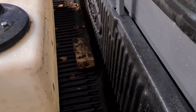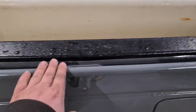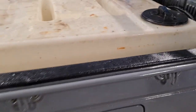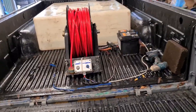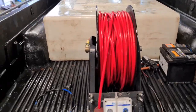So the plan is I'm going to push this tank further up to the bulkhead and put a bit of block of wood in there just to stop that snagging or kinking. Then we're going to weld some of this framework from these bars here, because obviously these are a good structural point of the truck - they're solid, they're what's used to strap heavy loads down on the vehicle. That's what we'll use to secure this. As you can see I had a temporary setup - I've been putting a sheet over it at night so the pump and stuff don't get wet.